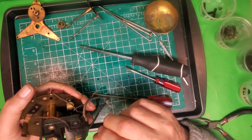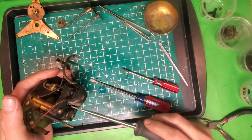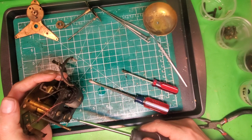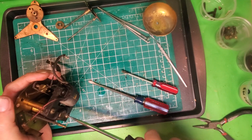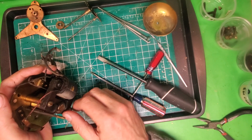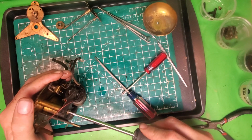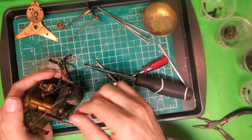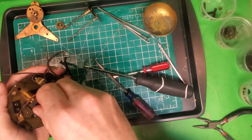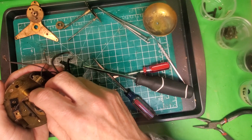All right, so once I have those 2 wires disconnected from the back plate, I'm going to go to these big chunky screws, take them out, and that will enable me to withdraw the coil and rotor. And what I'm going to do with the coil, I'm going to also wrap that in glass tape and coat it with liquid tape.